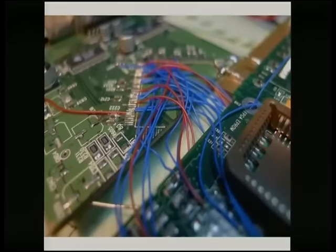I had an old TFT monitor, a desktop sort of thing, lying around. The controller board was all broken, except for the two fuzzy chips over there in the background. I can't remember whether it was a hacksaw or a circular saw, but I chopped out that bit of the PCB and kind of wedged it on there. And again, lots of little fly wires. So this is taking the parallel video data in the same way as the BeagleBoard hack and sending it into the LVDS serializers and then off to the panel. It's a very nice panel. It's 1280 by 1024 full color.